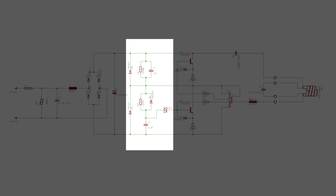When they start up they need something to actually get the circuit oscillating — once it starts oscillating it's fine. And that's exactly what we've had here: if I managed to get the thing to actually start, it would run properly without that initial trigger. Which might be something like turning it off and on repeatedly — it wouldn't actually get that oscillation going. So that led me to suspect some of the circuitry over there. The first thing I tested was DB3, the DIAC. That works properly — I tested it with a pygmy bulb and a 60V power supply, and as soon as I took the supply above 32V it started conducting, and conducted until the voltage dropped right back down to 5V. So the DIAC is fine.